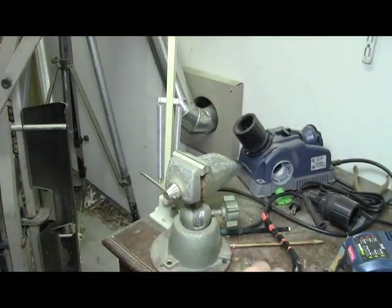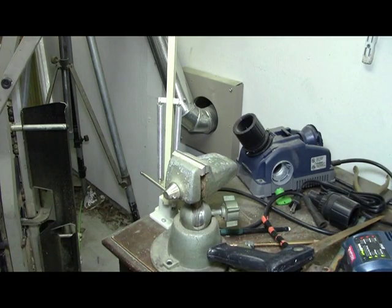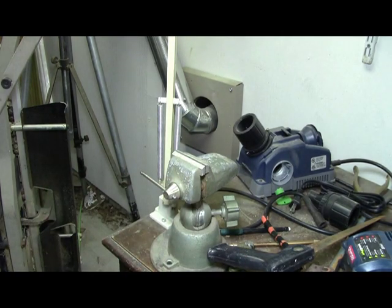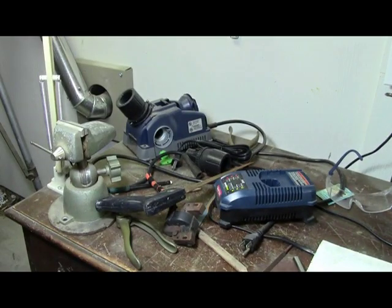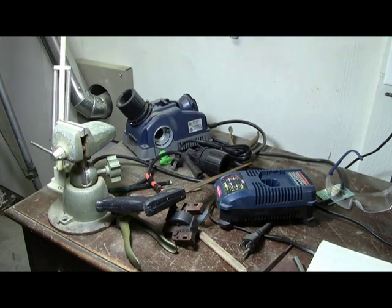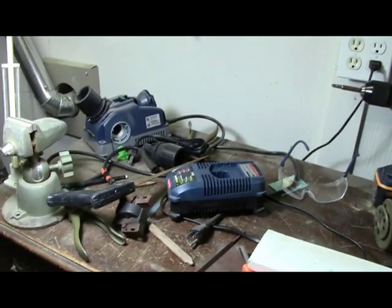Now there's another way that I don't even use that saw set, because sometimes it's kind of hard to move along without skipping teeth and one thing and another. Of course, I've gotten to where now what I do is I just do a tooth, I might skip three or four teeth, and then do the next one, just so that I can get this thing done in a hurry. Because most of the time, I'm on a job working and need to finish it, and I just need to get something to where it will actually cut and get off the job.